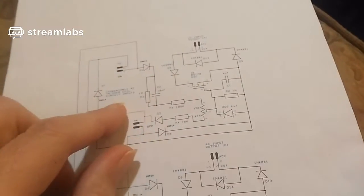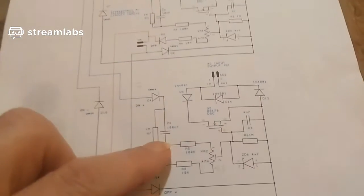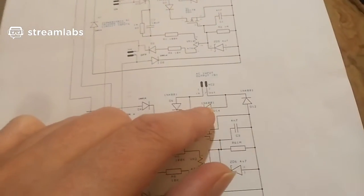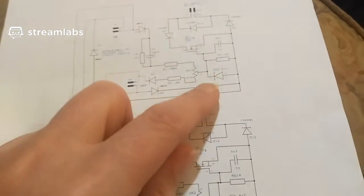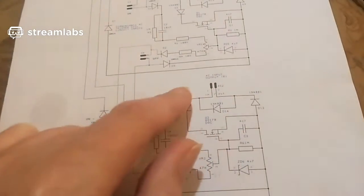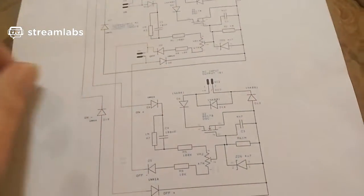because of the diodes and everything, what's happening is when I have it full wave and I have two sections with two MOSFETs, some of the DC pulses are coming from the other side and going all the way through the network, and basically it's feeding back into the system, and it's working opposite to the way it's supposed to work.